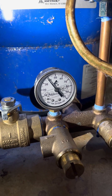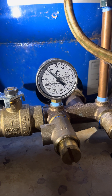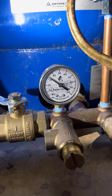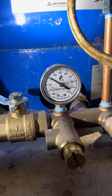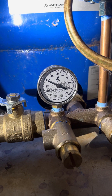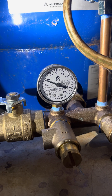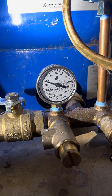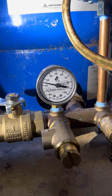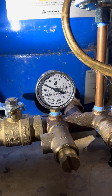This is all you do. And remember, don't touch anything inside here if your power's on — you will shock yourself, you could kill yourself, or at least get a nasty zap. So if it's kicking off at 48 psi, it should kick on right around 28. We're watching: 28, 27, 26, 25, 24 psi — so we could do another 2 to 3 full turns here. That's cutting off too low; I want to keep this pressure between 30 and 50.